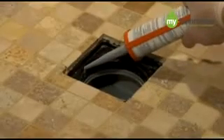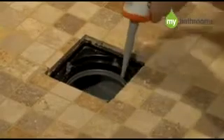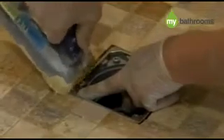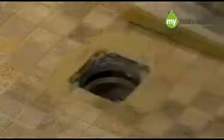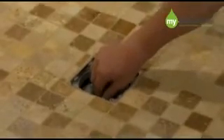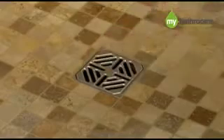This will ensure that it fits level with the finished tiles. To secure the shower top in place, use four blobs of Fix MD gun adhesive as shown. Then grout to the edge of the stainless steel rim. Drop the bowl into the drain and then push the internal dome into place so it fits tight as shown. A hair trap is also supplied and will drop into position. This is easily removable for future cleaning of the drain.